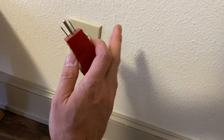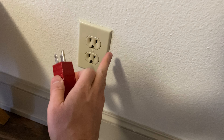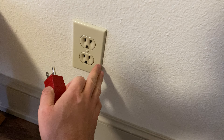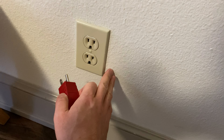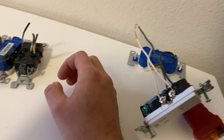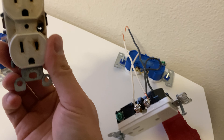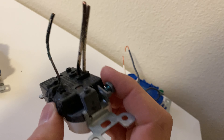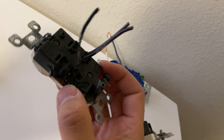As we move on to the next outlets and they're completely dead, you know that you've detected an outlet that has loose wiring or melted wiring. I'm going to show you a couple that I've just pulled out from recent troubleshootings where that's exactly what was happening.